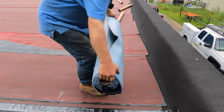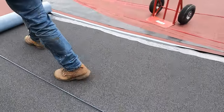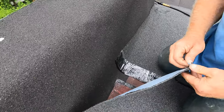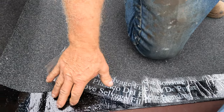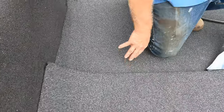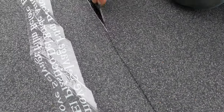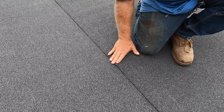Come to the next layer. You put your membrane down like that and roll it out completely. Then you remove two plastics — you remove this base and you remove this one together. This one covers this overlap here. Once this attaches, you cannot take it apart — so you've got to really be careful. Make sure it sticks — remove both plastics. Look, I can barely take it apart. If this gets hot you cannot take it apart at all. It's cool out now — about 70 degrees outside — but when the sun heats this, you're not going to take it apart.